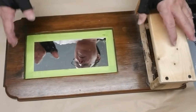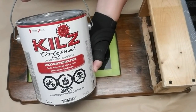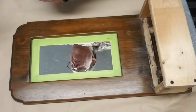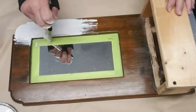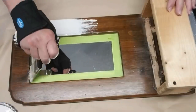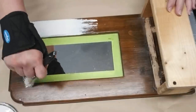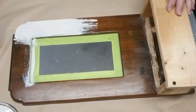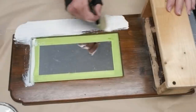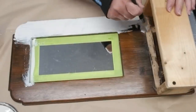Now it's time to paint. I've masked off the mirror and I'm going to start with Kilz Original primer — it's a stain blocker. I've noticed with darker stained wood pieces that sometimes the red tones bleed through and turn white paint pink, and I don't want that to happen anymore. I've had enough of those issues, so I've decided to just use the Kilz primer I had from a previous project at our cottage.